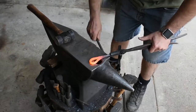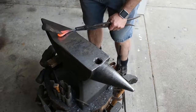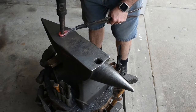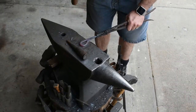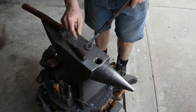That's not going to work, but this will. Now what I'm going to do is a little bit of drifting just to open it up, because this is the end that will be hooked. Now I have it nice and wide — open it up wide so you can see the forge weld took. That's good.